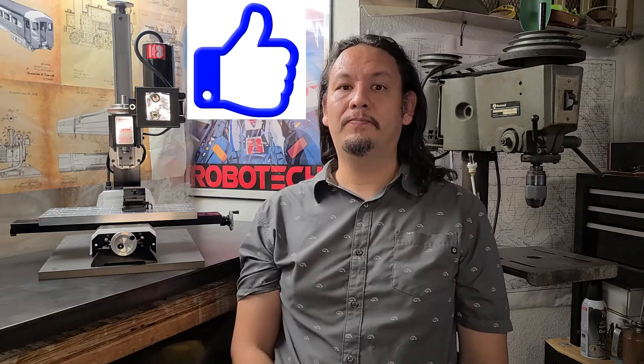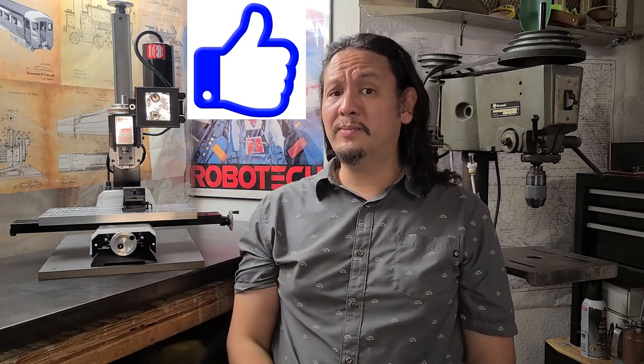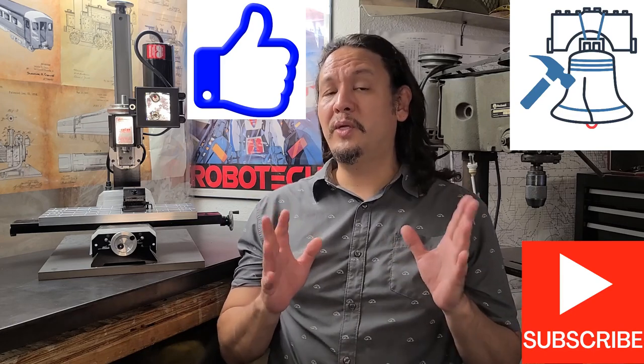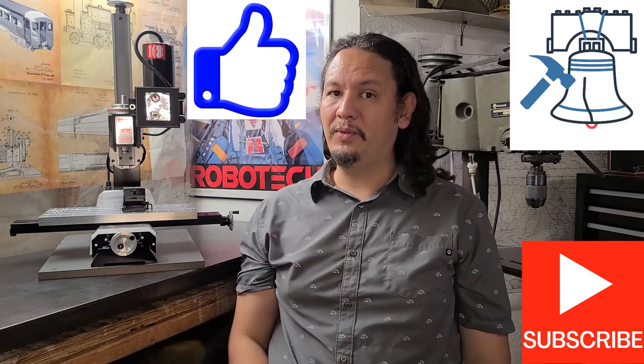That is it — I think this is decently trammed in. Not absolutely perfect, as there's a little bit of swing going toward the front of the vise, but that's something I'll address as I develop my process. I think I'm at a good enough place to make a square that Euclid would be proud to call his own. I'm really looking forward to showing you the first chips that I make on this mill, so be sure to hit that subscribe button and bell notification. Thank you so much for spending your time with me — until next time, have fun, stay safe, and keep making chips.